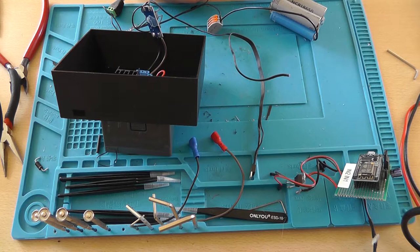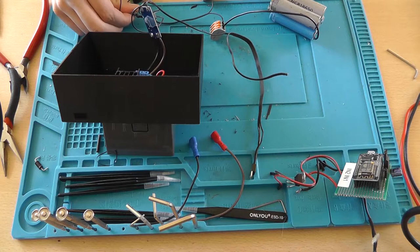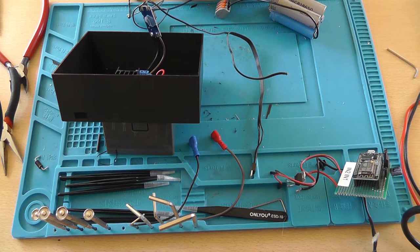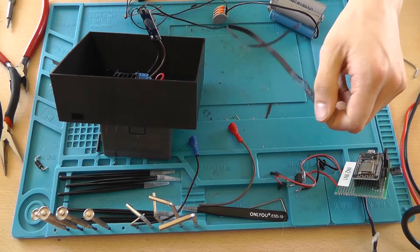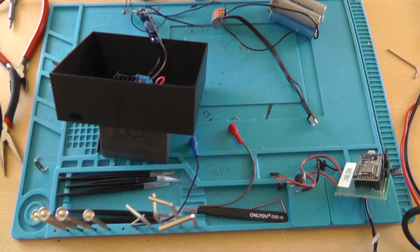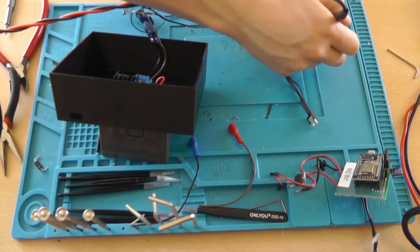And as you can see, I think something might have gone kaboom. And I'm not sure why. But hey. Let's measure the voltage on here. Yeah, that's not good. But nothing is warm, really. What's the input voltage of this boost converter at? 0. No, that's not good. What's the battery voltage? Yeah, the battery voltage is plenty.